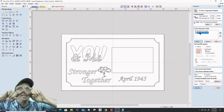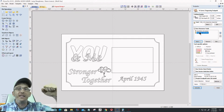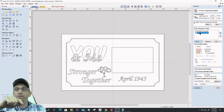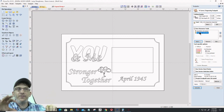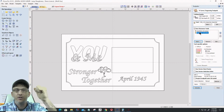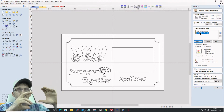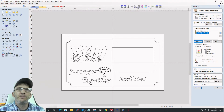So what this means is on this pocket area, the 1/4 inch is going to do all of its pocketing where it can fit, and where it can't, the 1/8 inch bit is going to come take over. And where the 1/8 inch can't fit, that 60-degree V-bit will come and do the final takeover, right? So that's what it means. I'm going to have 3 toolpaths just to do that one section for my top layer. Okay, so I'm starting at an 1/8 and cutting an 1/8.